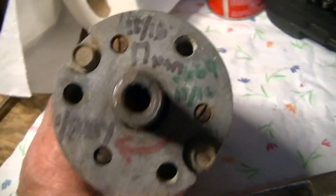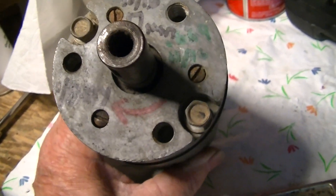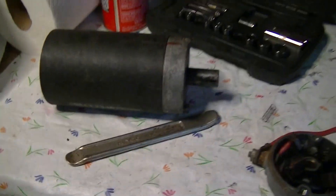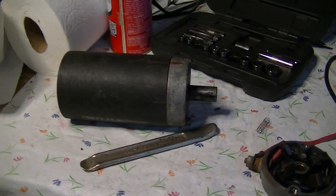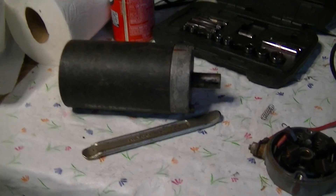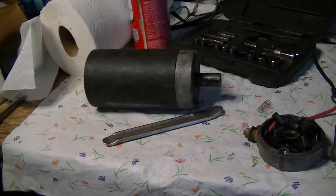So the way it's wired here, just using the polarity the way it came out of the mower, it rotates clockwise. So if it's mounted like this behind a Cushman engine, it'll turn that way. And with a V-belt to the old generator V-belt that's left over on all those clutches, it might start — but we'll see if it's got enough torque and power to do it.